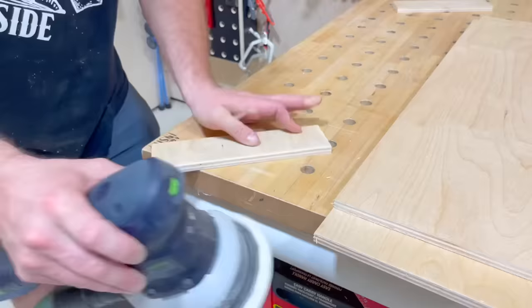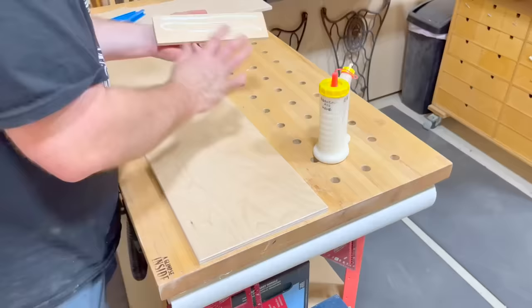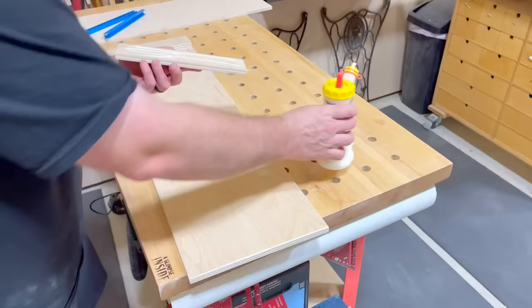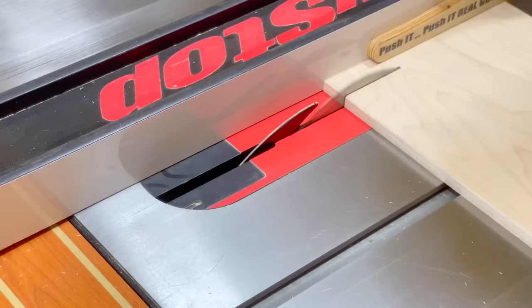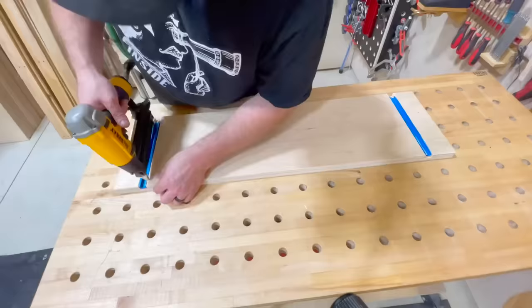This piece is going to be touched and used quite a bit, and it needs to be soft to the touch on the edges. You don't want to get a splinter while you're using your table saw — trust me, that is not a good situation. Now we're going to take those pieces we cut and tack them in place on the ends of one of those 30-inch pieces. We put our T-track down, make a small mark, cut it to size, and lay it in place. This layering effect is giving us that makeshift dado to hold the T-track.